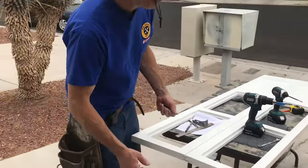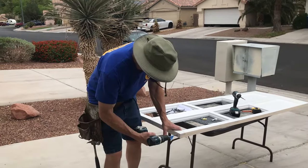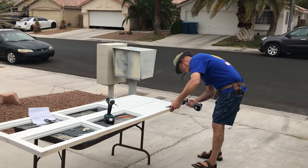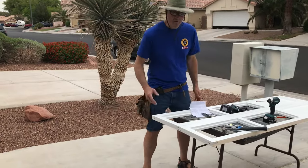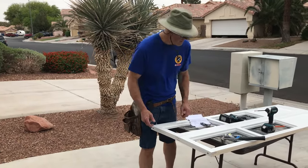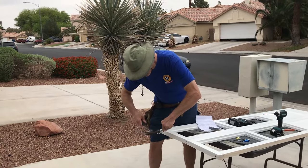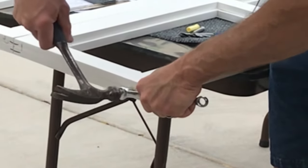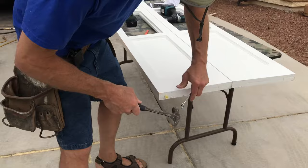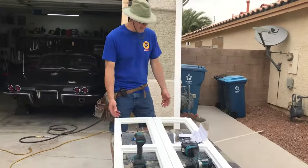So let's drill some holes. We've marked our depth with a piece of tape. We also use the center punch so that it will help start the drill bit. So that's got all the holes. If you had purchased doors, this is where you would be — door panels with pre-drilled holes that you would install the hardware into. So let's install our hardware. We're using a half-inch wrench so that we don't actually hit the hinge pin itself, because we've broken them in the past. That's the adjustable bottom hinge pin, and that's got them all in there.